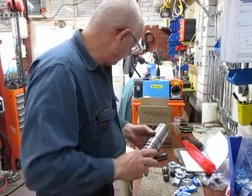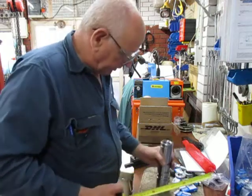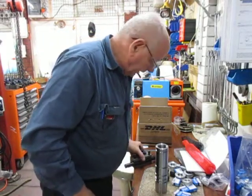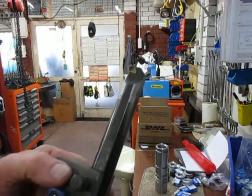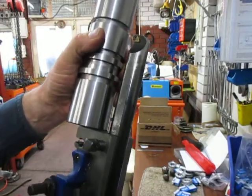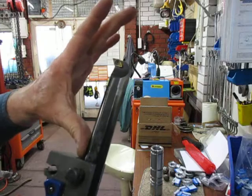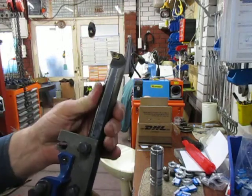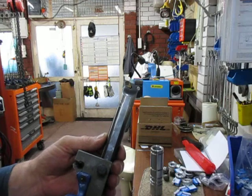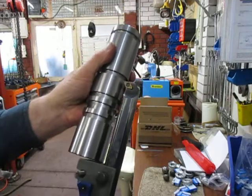In order to do this, this piece is 220 millimeters long — around about nine inches long. As I spoke in previous videos, we need to look out for the slenderness ratio of the tool: the diameter compared to how far you can protrude out before the boring bar starts singing and dancing around. There are a couple of ways to go about this particular job — it wasn't a problem to bore from one side and flip it over and bore from the other side.